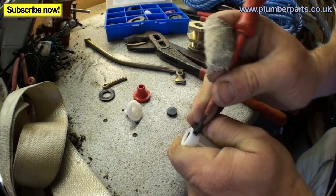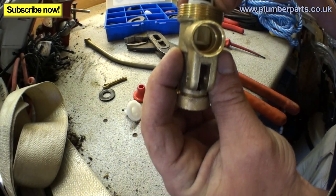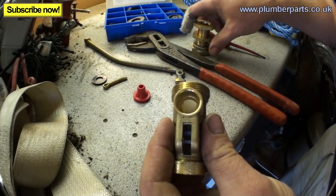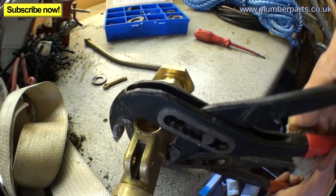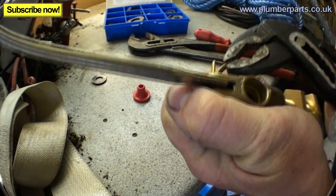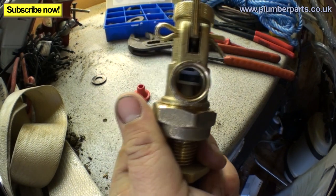This can be quite difficult to do sometimes - make sure you don't make a hole in your hand while you're trying to do it. There we go, there's the new one on. Now to reassemble the valve, get your valve body, make sure the slot is facing you, and it'll just slot in there. Put your jet in - your new jet if you like. Now we either replace this washer - I'm going to pop a new fiber washer in here, just like that. Push that back there, let the collar go down, screw this back up and tighten it up. Make sure the arm can get in - in goes the arm, push our pin back through, and split our pin so it can't come out. As you can see, there it is working properly. As this arm raises up with the ball valve float on it, it acts on our jet and creates a watertight seal.